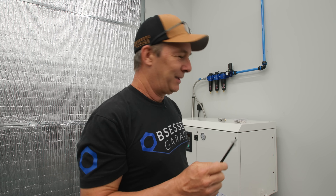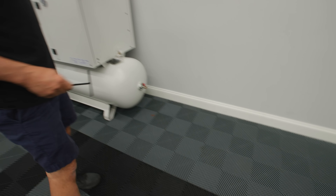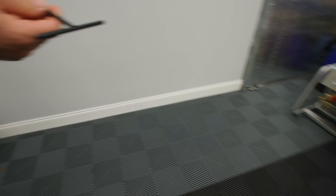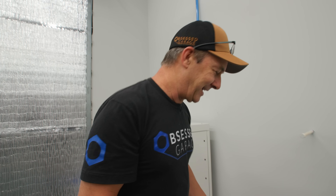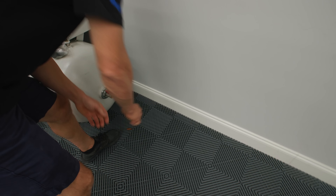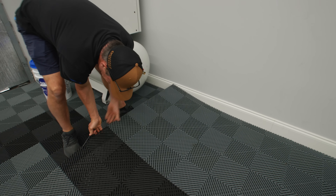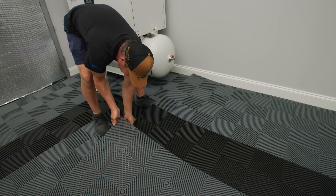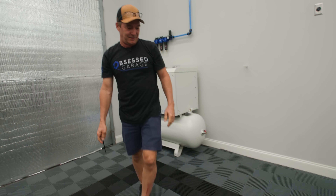So in the effort of keeping the place clean, I'm going to pop these tiles all the way around this area — I'm going to be cutting all this drywall. So tile popper: everybody complains about how if dirt gets under it you can't clean it, but it's super easy. Use the tile popper, stick it in here, step on this side, pull that side up. Simple as that. You can take a whole garage up in about five minutes.